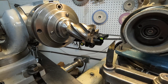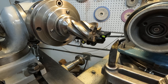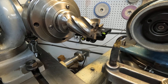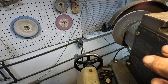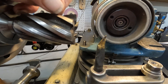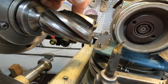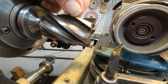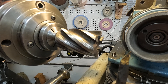That's the advantage of the cup wheel — it gives a little bit stronger edge, a little more support. With the hollow grind, they call it that because it's done with just a straight wheel. It'll leave a little bit of a radius on the flutes, and that makes it really sharp. But the edge may be a little bit weaker because of that tiny bit of radius. So that's a decision you have to make.